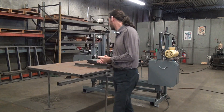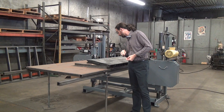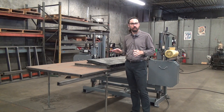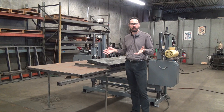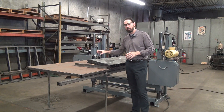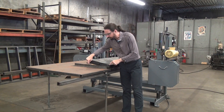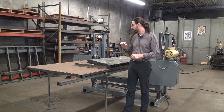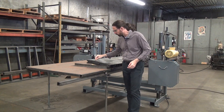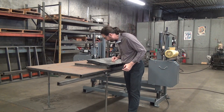Let's talk more action today. We're using a Model 480p to make test cuts on plastic — kind of like a pallet, but used as a flooring material. Say you're trying to use a grass field and set up a permanent installation like a concert, or protect the grass — you put down acres of this plastic material. The potential customer wants to cut this at an angle to give a nice taper effect at the edge of the field instead of a trip hazard. This material feels like UHMWPE, injection molded by the look of it, maybe a little filler.